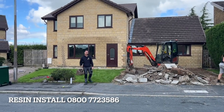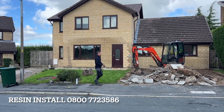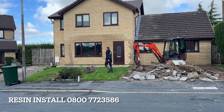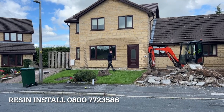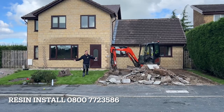So today we're in Shorelip. On this project it's very straightforward — what Razzy's doing, he's on the three-ton machine today ripping up all the old flags. They'll take up the block and also the grass; everything's going to be coming out. What the customer wants is grass from over at that corner there to around about where I've stood now, and we're going to put brand new turf in. We're going to be using a resin-bound mix, and the customer wants to park about three to four cars in this driveway, so that's going to be definitely possible.